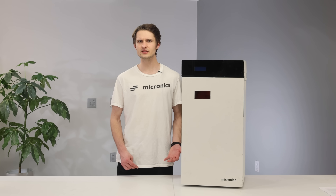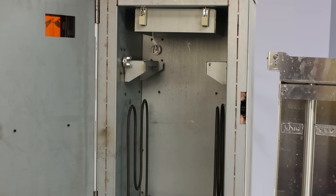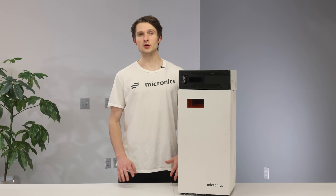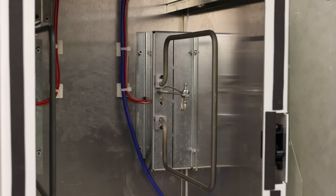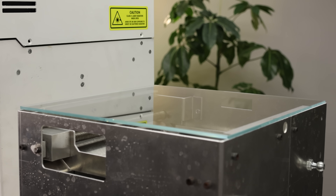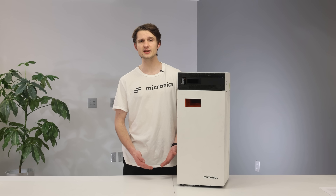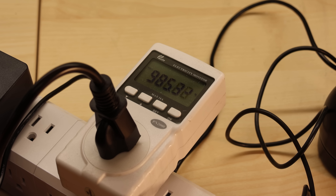After staring at this machine for a bit, we realized that the only things touching the powder are the build plate, build chamber walls, and the air on top. So what if instead of putting the entire thing into what is basically a giant oven, we just heat them directly? This brings us to our 4th prototype. Here, we attached heaters directly to the chamber walls, enclosed the air on top of the powder surface with a glass plate, and heated it with halogen lamps. With this design, we were able to reduce our heat-up time from 45 minutes to 15, and our average power consumption from 1000 watts to 450 watts.